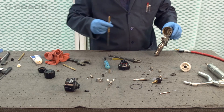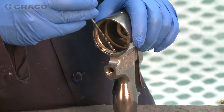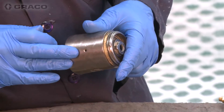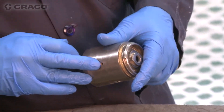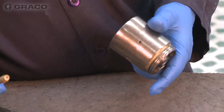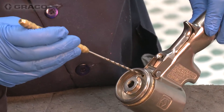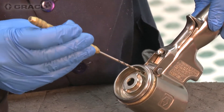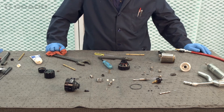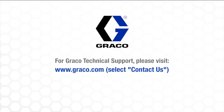You can see that we have all the air passageways. All of these passageways can be accessed straight on, with the exception of the one that goes down through the center — we have to remove this plug to gain access to that hole. And there's the one to the front for the clean-off. That gun is pretty much broken down. We'll get everything cleaned up and back together then.